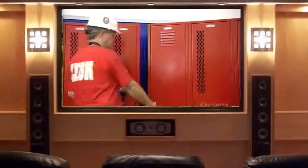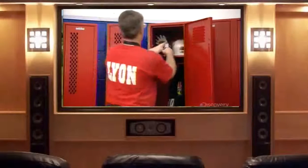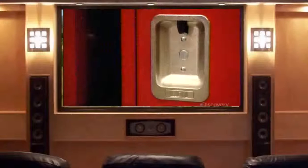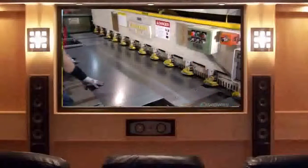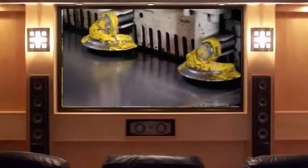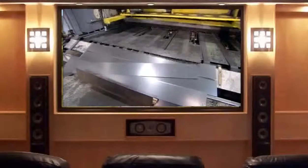While they vary in size and design, all lockers have ventilation holes that help air circulate and prevent odors. Lockers are made of a hard type of steel that's just flexible enough for presses to bend to the required shape. The steel sheets are 2.5 millimeters thick, and workers feed one at a time through a cutting tool called a square shear, which slices from one end of the sheet to the other, cutting pieces with the required width.